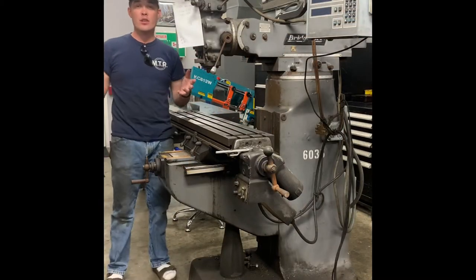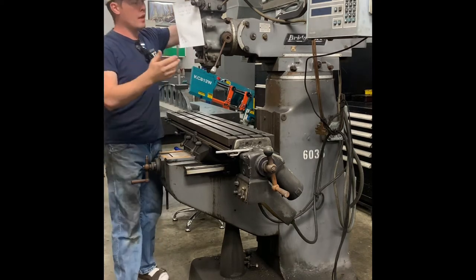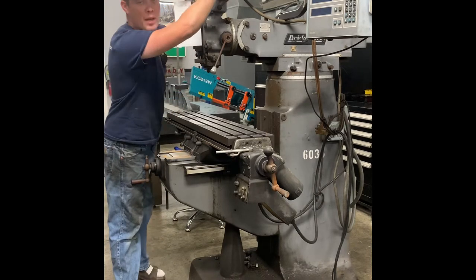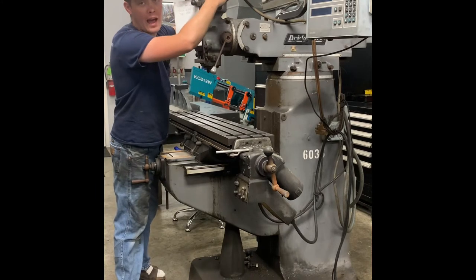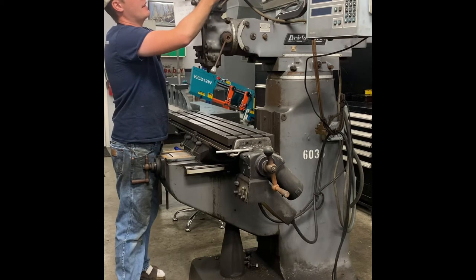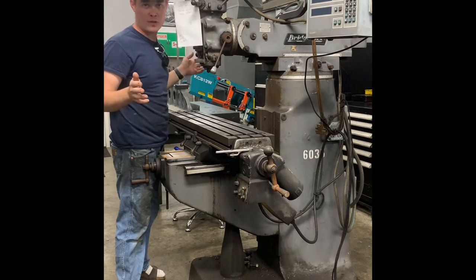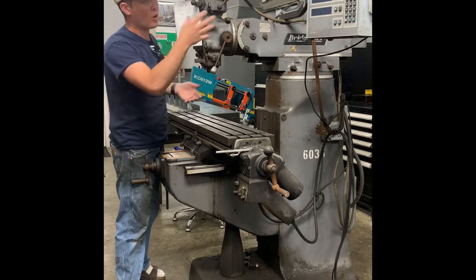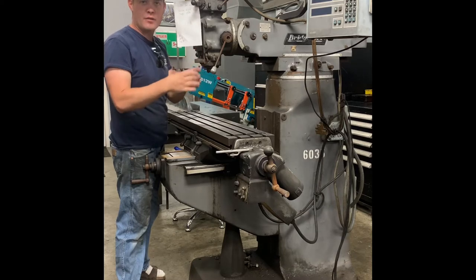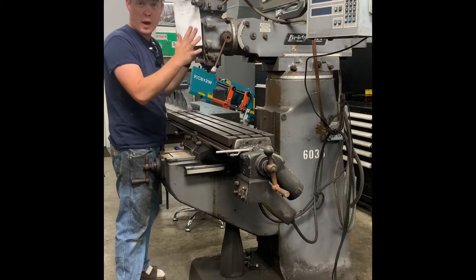The first thing we're going to do is address the head — rip this sucker apart right away. You can see it's super dirty and there's a little bit of rust on it here and there. Somewhere along the line somebody put a one-and-a-half horsepower motor on this two-horse 2J head, and that shouldn't be. The one-and-a-half horse motor was a flop. You should never buy one-and-a-half horse variable speed unless your budget doesn't allow a two horse. The motor armature is really small, the timing belt pulley is weird, and some of the older ones have only one screw bolt on the variable speed pulley lifter. It was just a bad design. The two-horsepower variable speed is what you want.